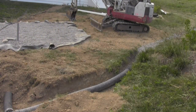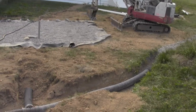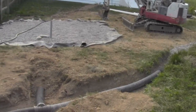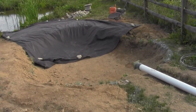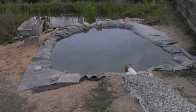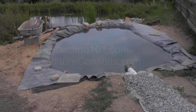I still need to line the drain trench here with pond liner and fill it with river rock. The connection to the wetland area also ties into a drain pipe that collects water from around the back of the house, so there'll be a junction there that connects over to the silt pond. The silt pond wall still needs to be built up a little — we've been compacting and building it up slowly. The silt pond is now full and spilling correctly. You can see the spillway down the back, and that pipe will be covered with rocks — it's the pipe coming in from the drainage and from the wetland area.